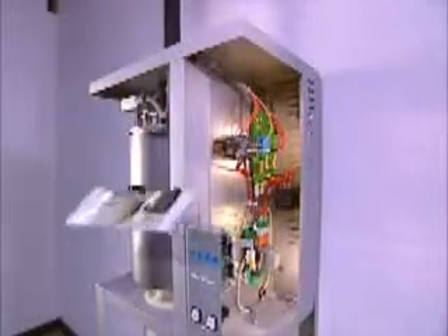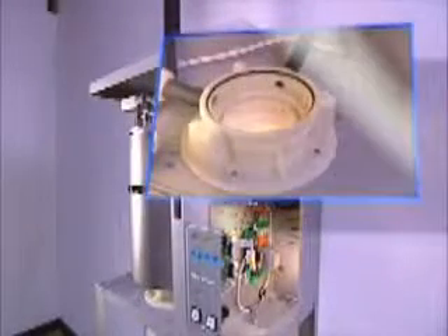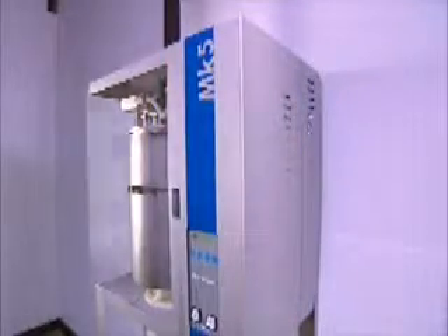The steam cylinder and electrical section are clearly separated and easily accessible. The specially designed cold water pool in the inlet-outlet area prevents the deposit of scale. Pipes cannot become blocked. The humidifier is robust and reliable.